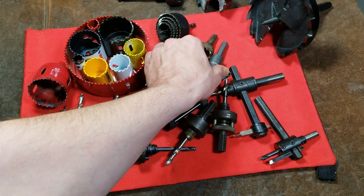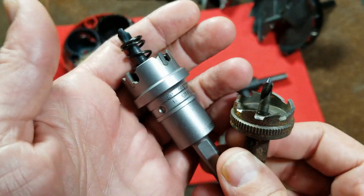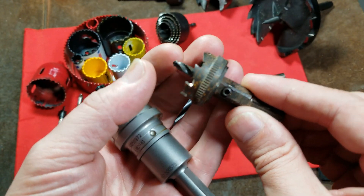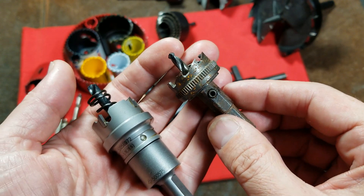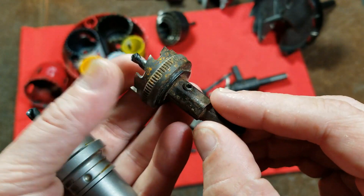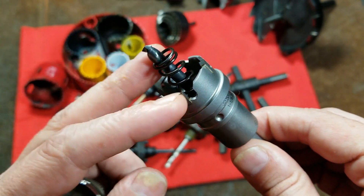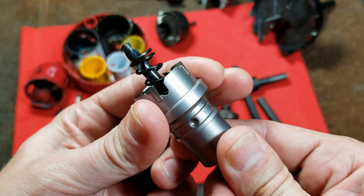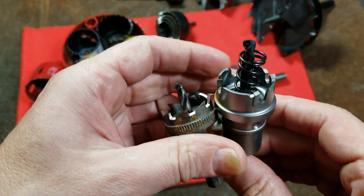Now let's get into hole saws. We'll talk about sheet metal hole saws — an older version and a slightly newer Greenlee with carbide tips. These are known as electricians' hole saws, for cutting small holes in sheet metal, primarily when installing conduit in electrical boxes. Many electrical boxes have pre-punch-outs, but may not have enough or in the exact placement needed. The Greenlee is a modern version with a spring that pushes out the metal disc so you don't have to remove the cutter and tap it out. On this Greenlee version, it's a quick release so you can change sizes.